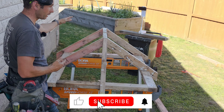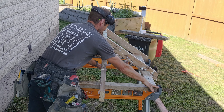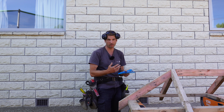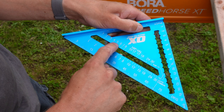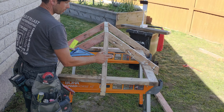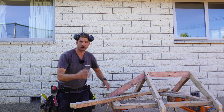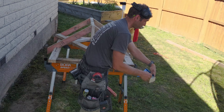Look what I've made. We've got a gable and over here we've got some hips — except we haven't actually got the hips on yet. The distance from the corner diagonally is longer than the distance across, and that means the angle is different — that's where the hip and valley angles come in. This is one of the benefits of using the rise and run method that they use in the States. Everything is cut at 35 degrees, which is a 7 on the common scale. So if we go to the hip valley scale and cut these at a 7, the angle should be perfect — however that only works if it's a right angle. If you've got a 45 degree corner on a house you're going to have to work that out manually. Cutting at 7 on the hip and valley scale works out at about 26 degrees for reference.